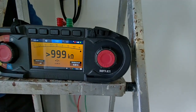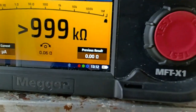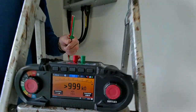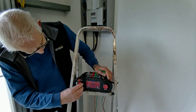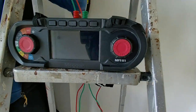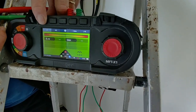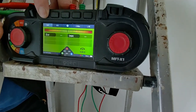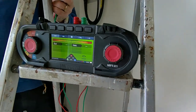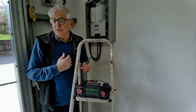The little dot at the bottom here shows me what the value of the leads are. That's going to be subtracted from any measurement I take from now on. Then I set the test instrument to impedance and using this hot key I set it to Z reference. That's my reference value, which is going to hold that value until I change it.